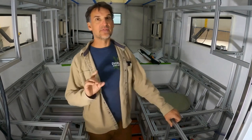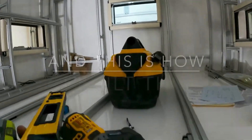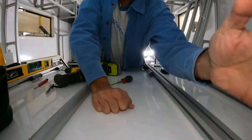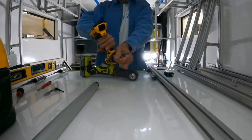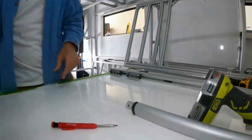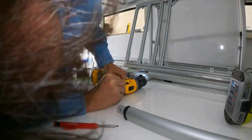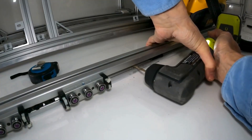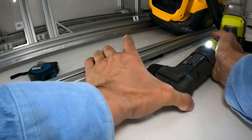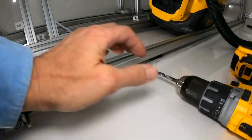It does all this for very low cost, incredibly strong, with very little energy draw — only when moving. So it's kind of a no-brainer. There was a little bit about why I built it this way, and the main reason was also to get this dining room table out of the way when getting out of the bed. This is the bed area up here — the dining room table slides underneath. The bed also slides out over the dining room table when it's in its open position, so they all basically recess into each other. The way I built this, going back a long time ago, is I glued down 80/20 one-and-a-half-inch profiles down onto the bed platform, the bottom of this bed platform — and they are glued down, four of them.